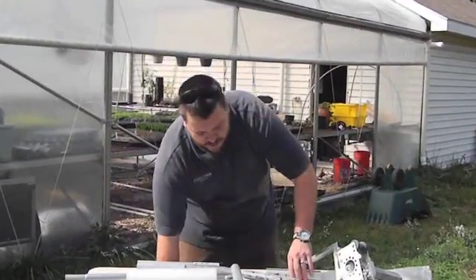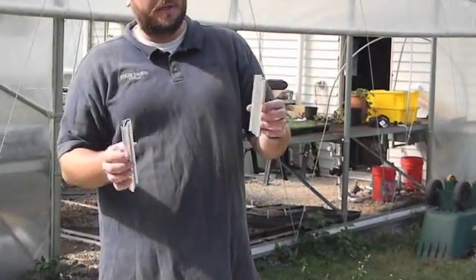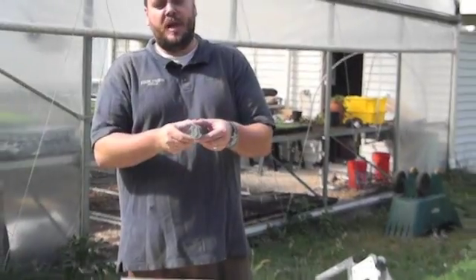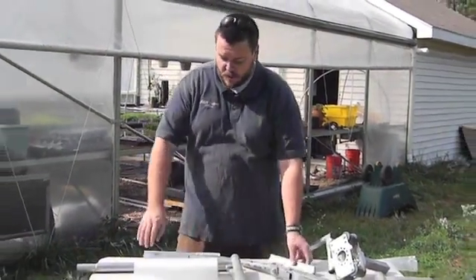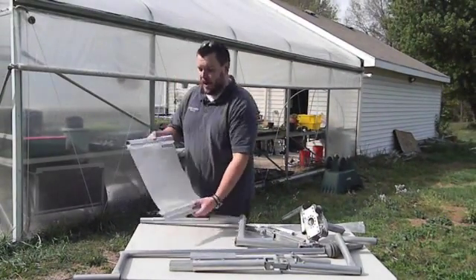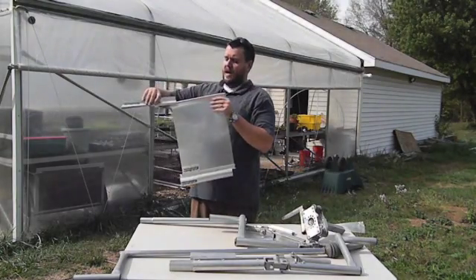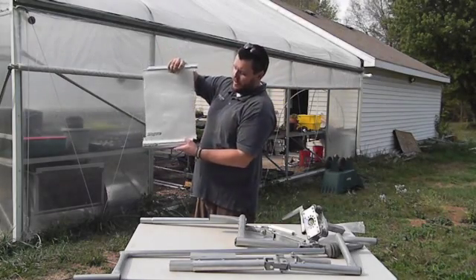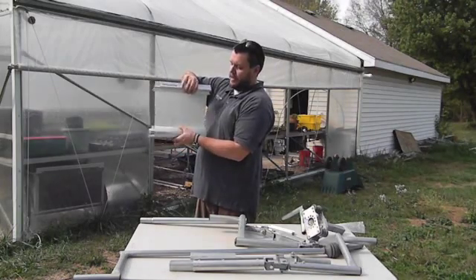Here's another version I haven't seen in a while but it's still a neat concept — a roll bar that comes in two pieces. The plastic goes in between the two pieces and these are either screwed or bolted together to attach the plastic to the roll bars. There's also a reinforced woven poly version where an aluminum extrusion on top slides the roll-up curtain in, and roll bars slide in and out of the curtain so it can roll up in a similar way.